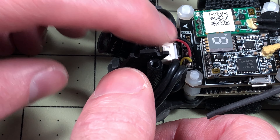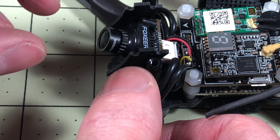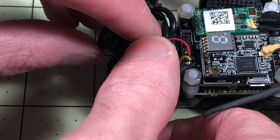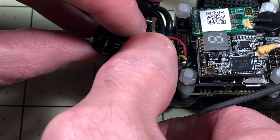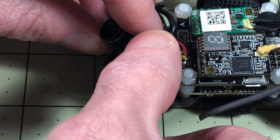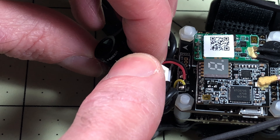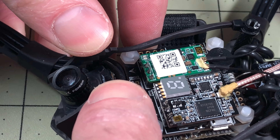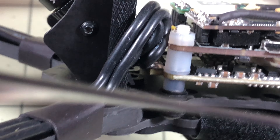The wires are really close to the flight controller and I thought they were hitting, but they're not. You might be able to adjust this without taking off the top plate, but it's much safer with the top off since you have a little more give. The wires were catching when it was all tight on the flight controller. If I move the top plate, I can slide the camera forward a little bit to get more than enough camera angle. For a full 90 degrees you'd have to move some wires out of the way, but you can get a ridiculous camera angle without any major mods. In my case that's about 50 degrees.